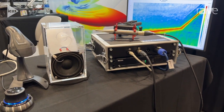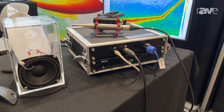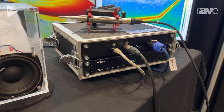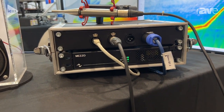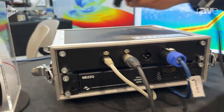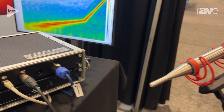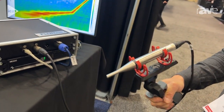We don't use any of the Klippel analyzers here. We just rely on a PowerSoft Mezzo amplifier as our test front-end. We're using Dante to stream the voltage and current — the impedance test that we get from the speaker — through the Dante network. We even hooked up the test microphone to the Mezzo and just stream it back through the Dante channel to the Klippel QC standalone software.